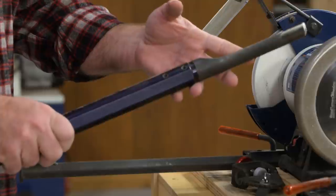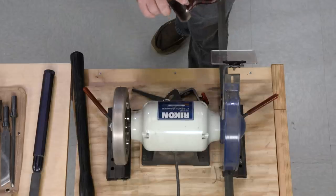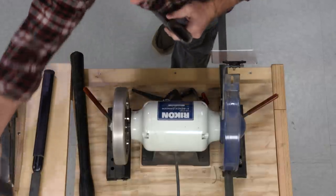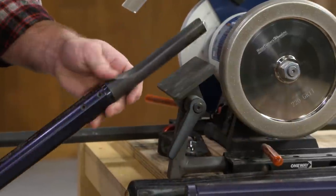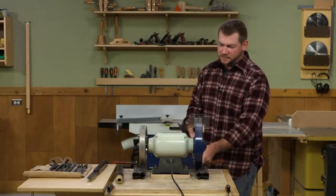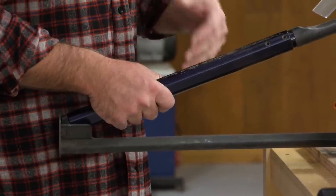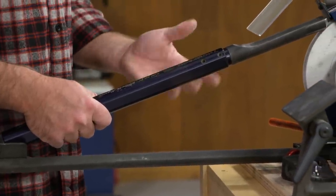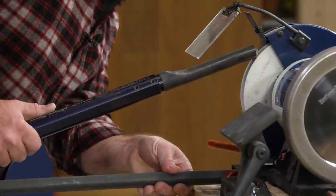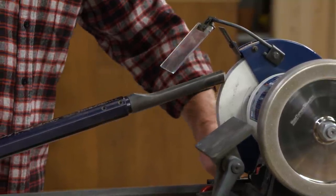As the tool gets shorter as you're sharpening it, it can actually cause it to pinch in the CBN wheel and damage it pretty bad. Almost every CBN wheel manufacturer will tell you: do not use a spindle roughing gouge with the V-arm on the CBN wheel. If you're going to use the CBN wheel, you'll have to use the angled platform — just lock it in place, hold the tool flat, and roll it. With the V-arm installed on the traditional stone, I go ahead and set my angle. I don't get too caught up on bevel angle — I generally keep whatever the manufacturer supplied. Most of my tools are from Doug Thompson at Thompson Tools, and I like the grinds he has on there initially. So I pull this out until the bevel on the spindle roughing gouge is laying flat against the wheel, and then lock the V-arm into place.